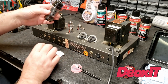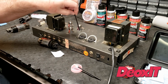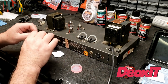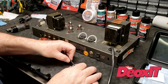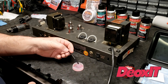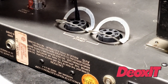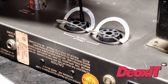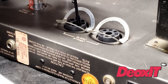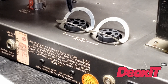We're going to set the tube aside for a minute. I'm going to use this fantastic little brush that they give us — just the right size for getting into the receptacles. I'm going to apply some of the chemical to the bristles — get a bunch of it on there. But it's not dripping, which is nice; it's thick enough. You can reach inside right to the metal pin receptacles and get it right where it's needed. This will help to clean. Now you have clean receptacles and clean pins. When you put everything together, you're going to have great electronic connectivity and lots of surface contact area.